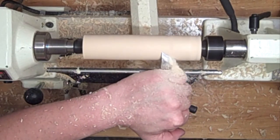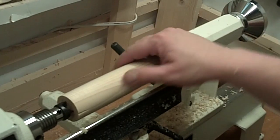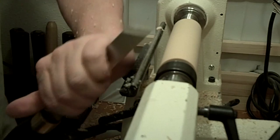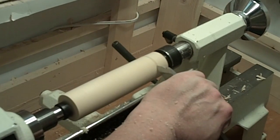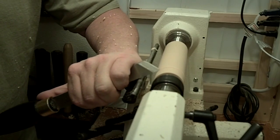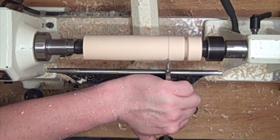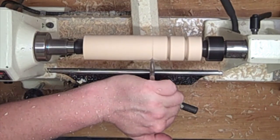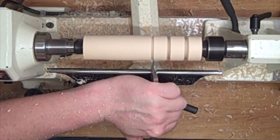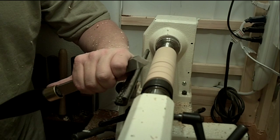If you increase that 45 degrees, it's kind of like working on hardwoods with hand planes — a highly figured wood with an increased angle will smooth it out. Now we're going to start practicing our cuts. The first ones I'm going to do is a V cut. Notice I start way above it and come down until the point hits and then I arch in towards the center. Once you make that initial V, you come in on the sides, using the side of the edge as my bevel — so I have two bevels on the left side and the right side. First I create a V, then I ride the side bevels into the bottom. With a V cut though, you can't go too far because once you get past the bevels you're basically just pressing in. This is what's called a slicing cut — I'm actually slicing across grain into the wood.